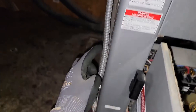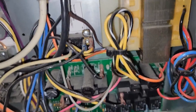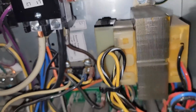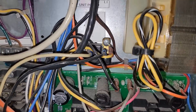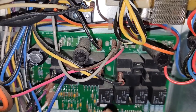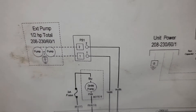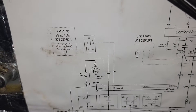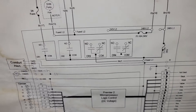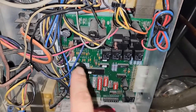The power wire from the pump runs alongside the geo unit and goes into the geo unit. This is the power for the pumps — it lands on what looks like PB1, which says 'source pump power supply.' You can see there are some relays here with a gray wire and a yellow wire that land on a relay, and there's a fuse in line too. On the schematic, our external pumps land on PB1, and you've got a yellow and gray wire on a normally open contact that closes to provide power to the pump. The board controls when that relay closes based on the call. Remember, you've got an inline fuse — so if you don't have power at PB1, check the fuse if you've got power into the board.